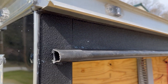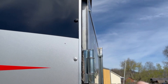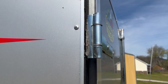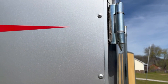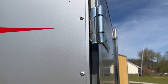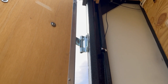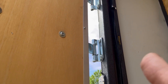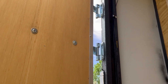I wanted to show you another thing about the hinge, which is a big part of the problem. There's a giant gap at the top, and part of the issue is this hinge. It's kind of hard to tell probably on video, but it's not seated flat to start with. And then this beam it's mounted to is bent in, so it's keeping this hinge from pulling the door all the way up. From the inside I can tell that this beam here is tweaked up near the top two hinges — it's actually bent in. It's probably what happened when they were mounting the door — somebody was careless and they tweaked it and pulled it in too hard and just bent that beam.